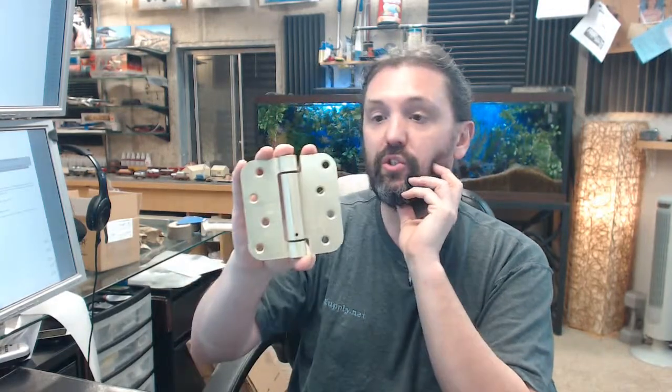If it's a 3 foot by 6 foot 8 solid 20-minute particle board filled door on an attached garage in a home, that's heavy. That's about 6.5 pounds per square foot generally. So if you do the math, that door ends up pushing for sure the 90-pound range that you're in for these hinges. And that's a very common application.